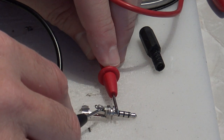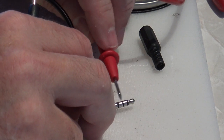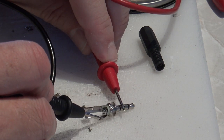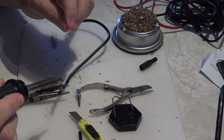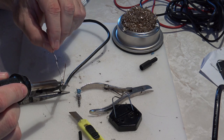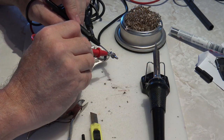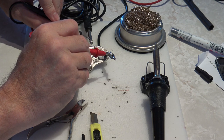If you're not sure which tabs on the back are number three and number four — which is the positive for the microphone and the ground — a little tester will help. Document and remember those, because they're the ones you're going to be soldering to in the next step. Tin up your ends, make sure everything is nice and solid. We only need two connectors: the common and the positive. Once done, test everything before you button it up to make sure it's all working properly.